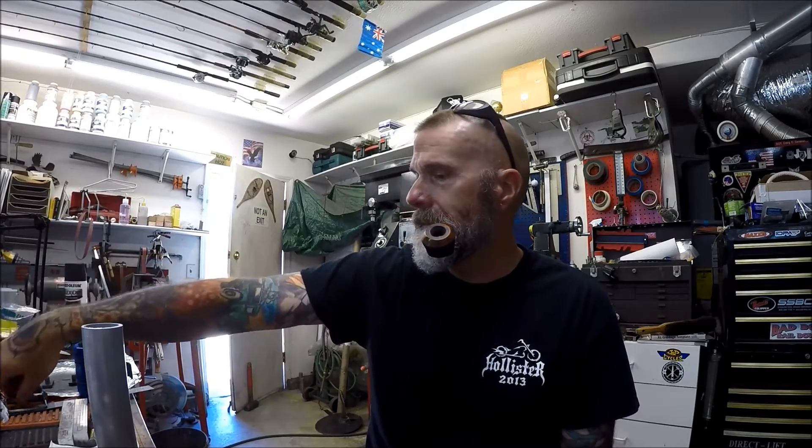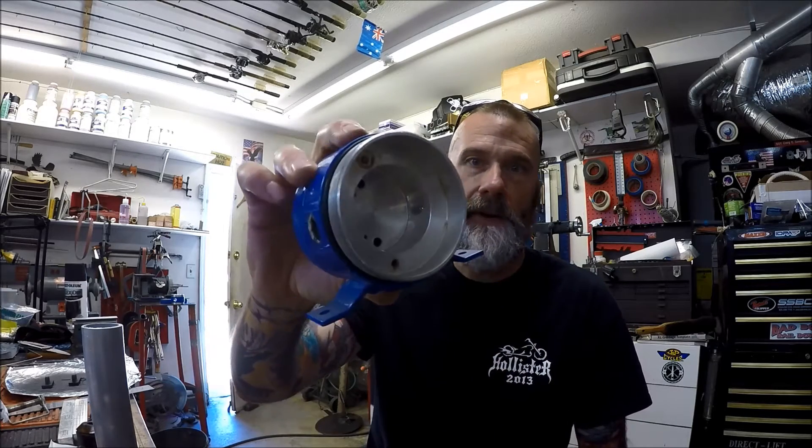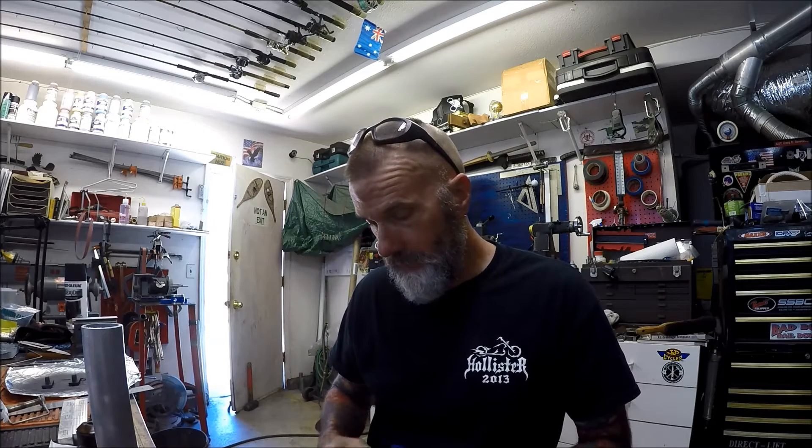It's kind of fun. I plan to make a couple little boxes to put out - like years ago - and it's one of those projects that got put on the back burner. A couple of buddies of mine recently reminded me of it; they both have an interest in geocaching. So what these are is old transmitter housings - both sides are threaded, o-ring sealed, held various electronic parts. It was for tank level transmission. What I'm gonna do is hollow it out - pretty simple. Take it apart, put a hole in the center, start boring it clean, and then give them to my buddies to put out in the world somewhere.